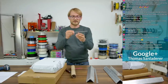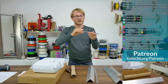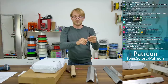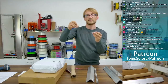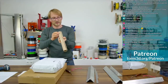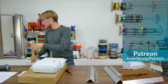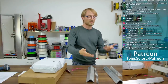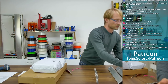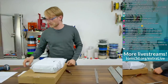So it's going to be interesting to see how that affects backlash, and how it affects torque, linear torque, because these things basically convert, linear torque, that's just force. Basically, these convert rotational torque into linear force. So a higher pitch would make for less linear force for the same torque, but a faster feed rate. So that's going to be interesting to see where that trade-off lands. If it's going to be skipping steps by just the dynamic cutting forces, or if it's actually enough and it makes for a nice, smooth, and quick milling experience.